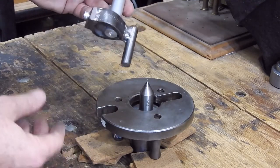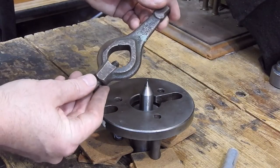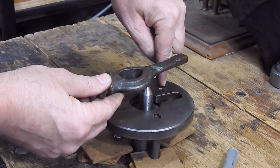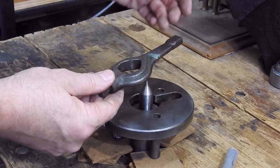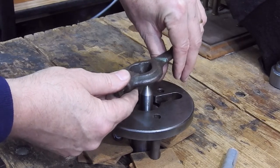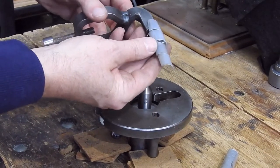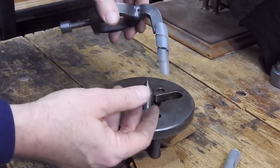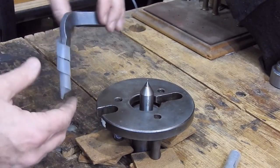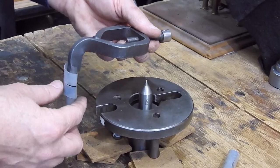There are a couple of types around the place. If you've got a lathe with a drive plate which has got a pin on it, you can use a flat one like that. Same thing applies, it clamps onto the work, but you've got a pin so it drives against the pin. Some people, to stop vibration, will wire that — a bit of fencing wire — to the pin, and that's quite acceptable. With this style you can't do that, so what I do is use a piece of plastic or rubber hose or something like that, and locate that in there as a cushioning thing to try and stop it, because otherwise it gets a little bit annoying — you get a clack, clack, clack. Not so bad when you're cutting a thread, but if you're doing an interrupted cut you will notice it.